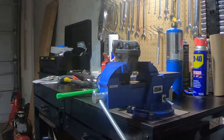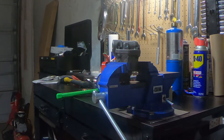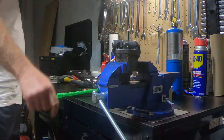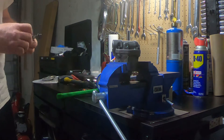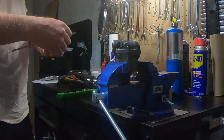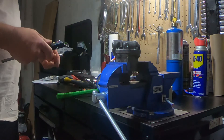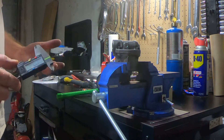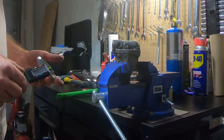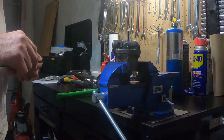What we're going to do here is try to get this oil pump pickup tube into the oil pump. I've already kind of dry fit it, and I know these are supposed to be a tolerance-to-interference fit where the opening is tighter than the pickup tube diameter by a certain amount — because there's no bolt that holds this together, no gasket, no washer, nothing except tension.